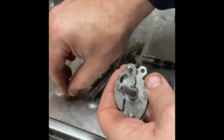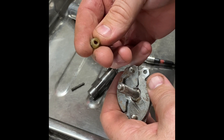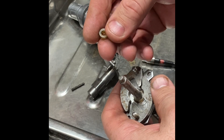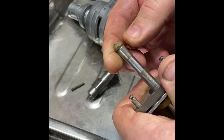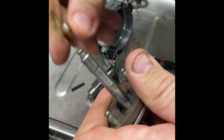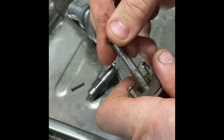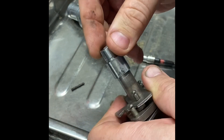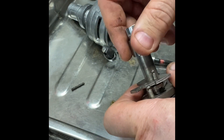Inside is the little plastic clip. That plastic clip is okay when it's first put on at the factory, but if you take it off and put it back on, you will find that it will wear out and become looser. So eventually, when that's clipped over the end, although it will clip on, it's easy enough to pull off. The problem is it becomes unreliable, especially if you've got the rotor arm in place — you pull the rotor arm off and the whole thing comes up and bends all your springs on the bottom.